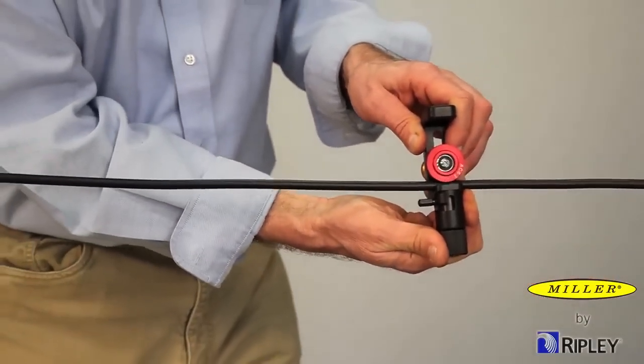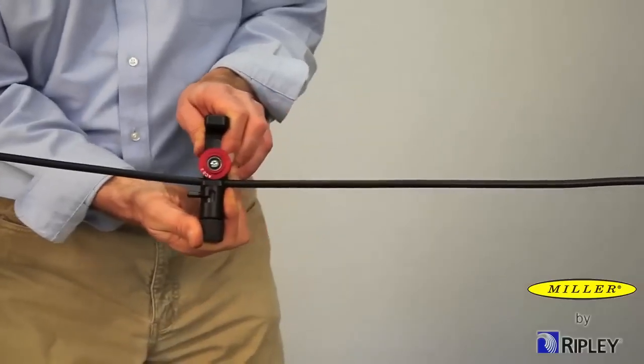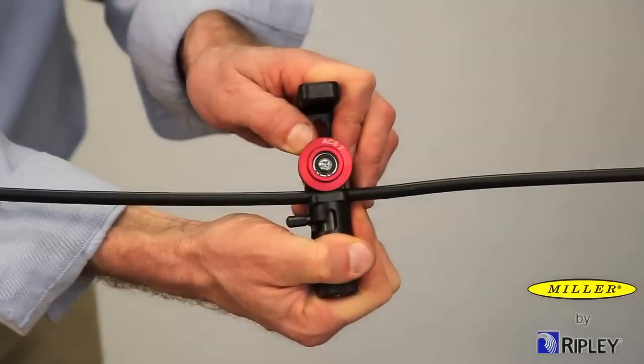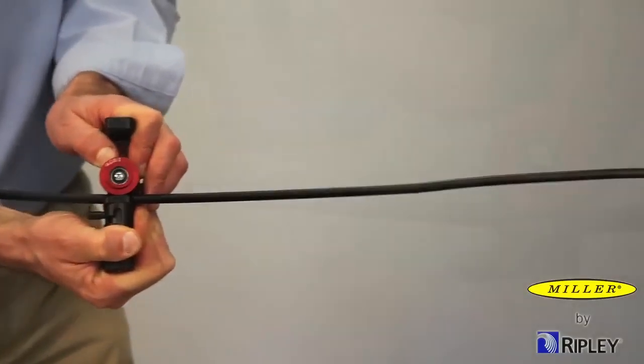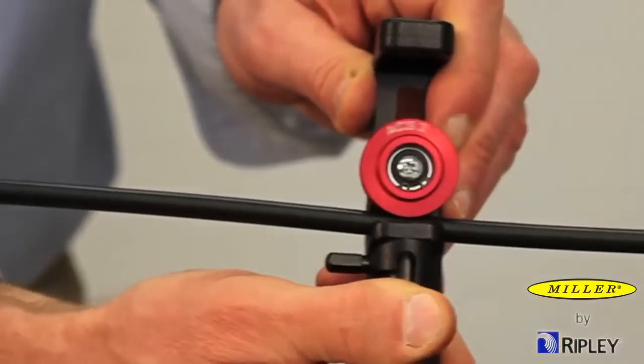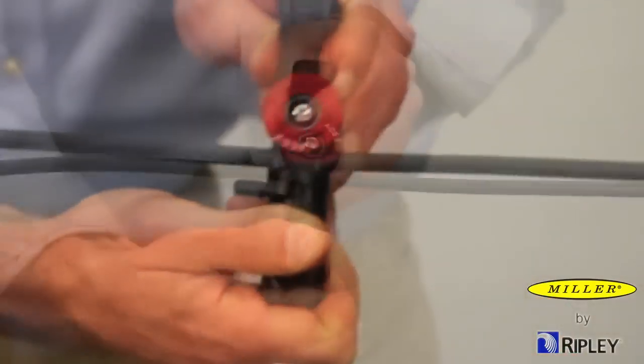When the blade is set properly, the tool will often create a zipper sound on armored cable. If you are working on an external strength member cable with a lay, the tool will follow the hardened strength members and slightly spiral down the cable. Allow the tool to follow the strength member.